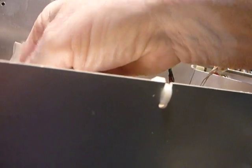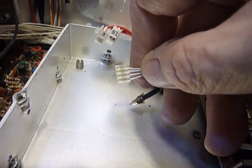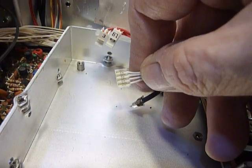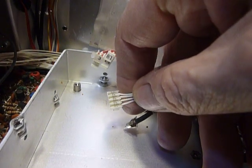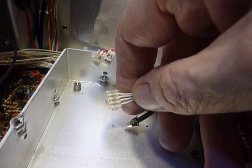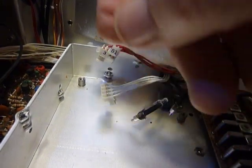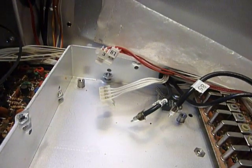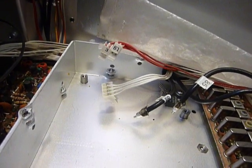Some things I noticed about this: the connectors. These use little snap-in connectors. The wires are just pushed down into a tight-fitting little V that cuts through the insulation. I really don't like that. I like to see the pins crimped on, or soldered on is better yet. But this thing is loaded with these little connectors. They seem to be working so far, so I'll let that go. But I would prefer to see soldered wires.